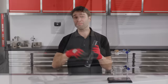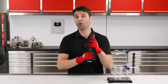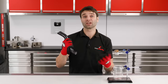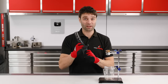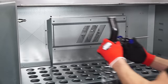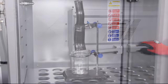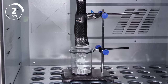We're now ready to put these components back into the oven, raise the temperature above the melting point, and drain that alloy core out from the middle. When doing this, it is really important to support the part in such a way that when the metal drains out, it will drain into a container so it can be reused. For this part, I've got a lab retort stand, which makes a really convenient way of clamping it. At this stage the part is not fully post-cured, so it is important to raise the temperature progressively. By doing it progressively, you will not excessively soften the resin, and I'm following the Xpreg post-cure cycle, which finishes at 130 degrees C.